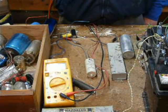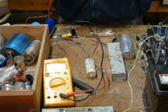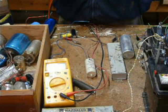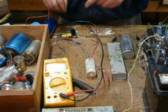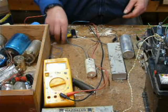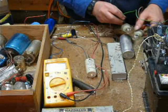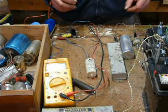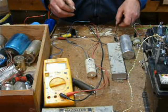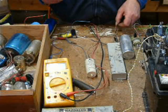To that end, what we've got here is two 12-volt car batteries in series giving 24 volts — actually about 25.5 volts. The positive comes around here, and the negative goes through two indicator bulbs. Now those two indicator bulbs do two things: one, they're a resistance, so we don't get lots of current flowing if we short things out.